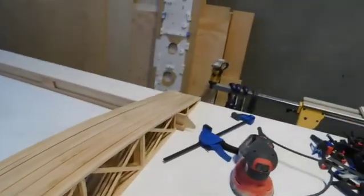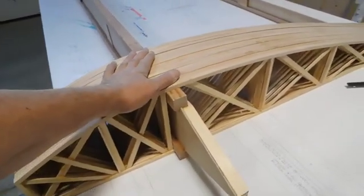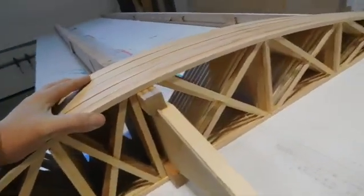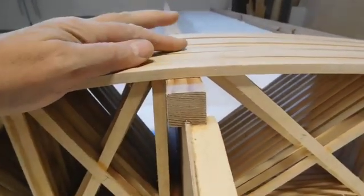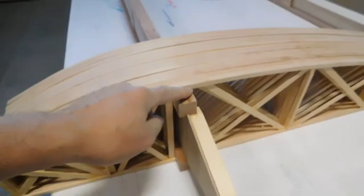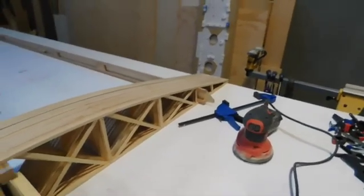They're pretty darn straight, the front and the back. Again, it's just interesting that they all came from the same jig. Some of them are a little tighter than others when it goes onto the spar, and that's fine. In the plans it says this one looks pretty equal, the space across there. Sometimes there'll be a bit of a space at the back, they say, to just put a little shim in there. So I'll watch which ones those are when we get them separated. This one's tight, so I would understand that it's a bit tighter. Some of them fit a bit looser. I might be able to slide a bit of a wedge in there just to tighten that up. But they all fit on there just the way it's supposed to.